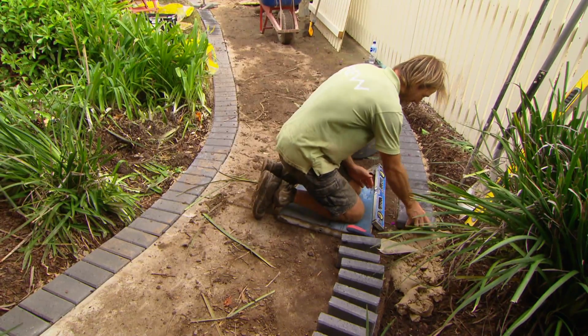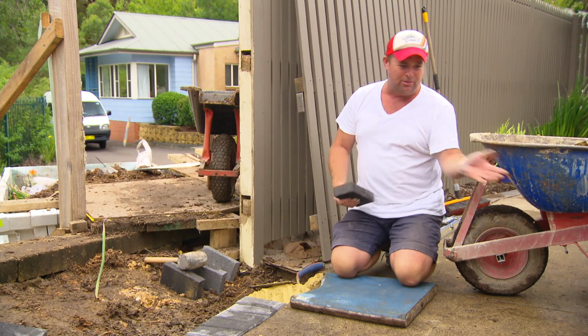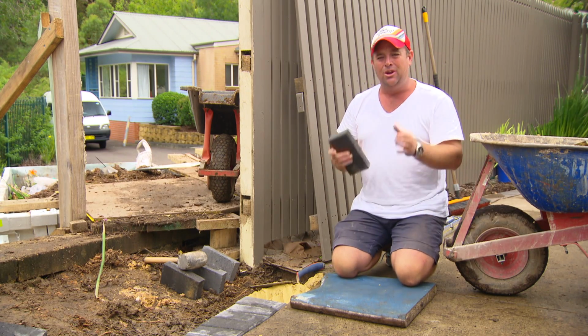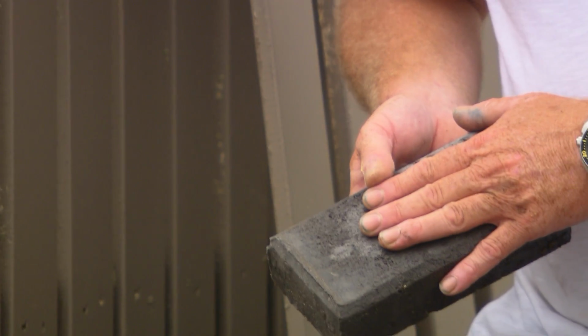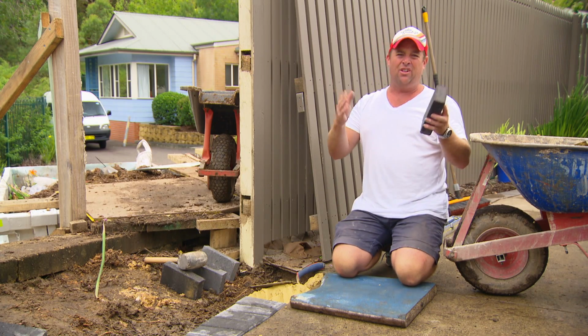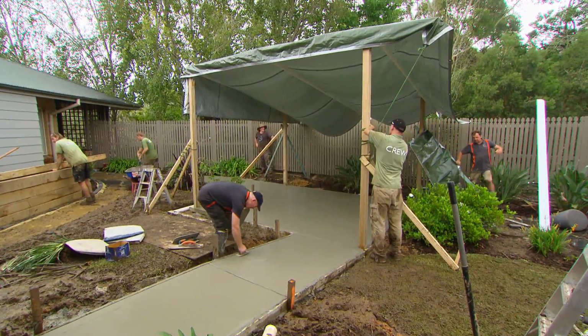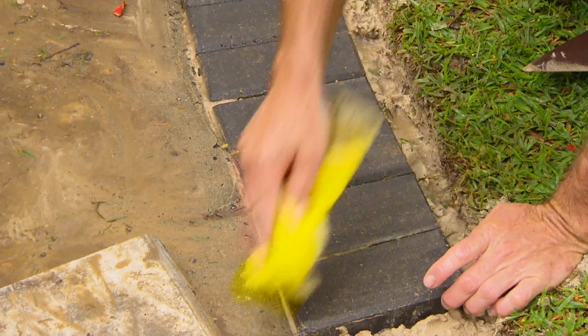And by adding this brick on both sides, which are little briquettes, they're 200mm, so 200 plus 200, I'm adding 400mm. I'm turning the path from 1200 to 1600. The contrasting colour of the brick highlights the edges, and visually these stand out. In fact, they're kind of like the lights on a runway. Well, with the concrete poured and the pavers just about there, coming up,